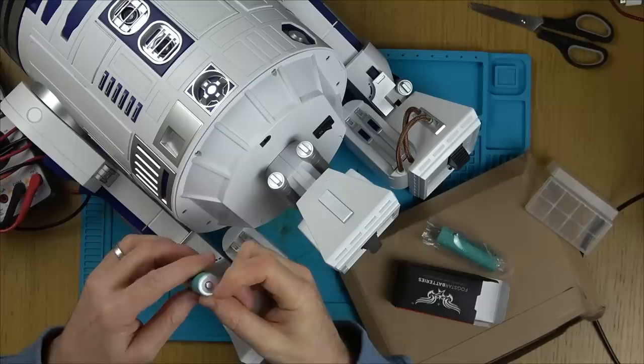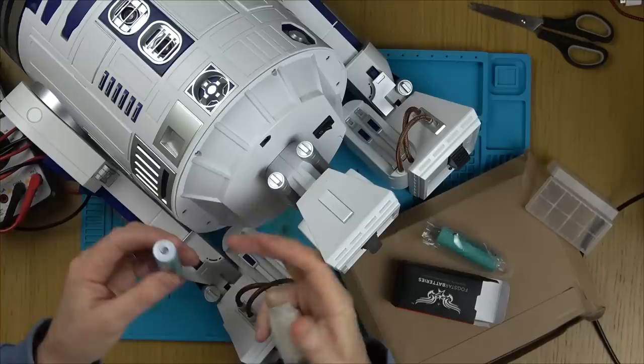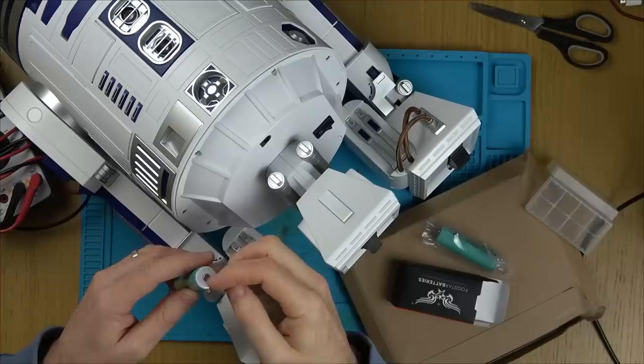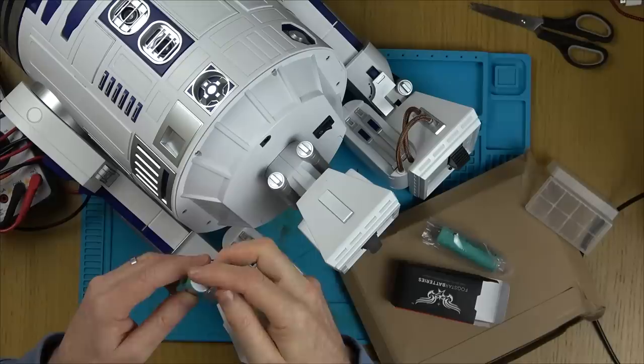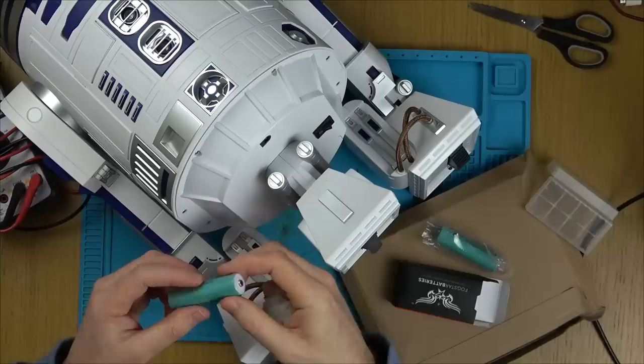You have a plastic ring around here, and can you see there's plastic going all the way down, so the positive is isolated from the negative. Obviously if it shorts there's a huge amount of power in these and they can go and fire and explode very easily and cause serious damage. If you were rough putting them in and scored onto the negative case, when you put the foil on top it could easily dislodge and short between there and the cover.